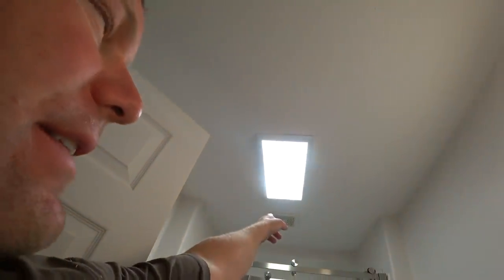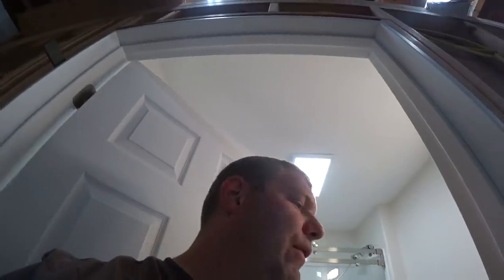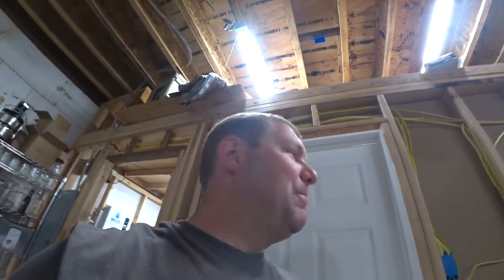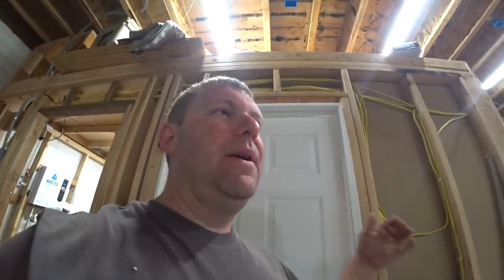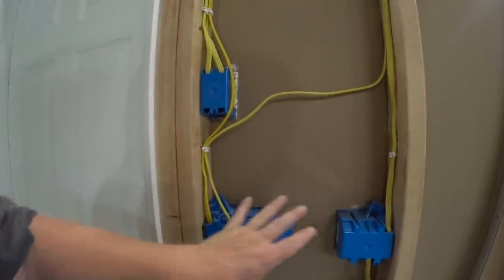If you've seen the video where we failed our first electrical inspection, that's one of those little details that we didn't get right. In our bathroom circuit, we actually have a fan and a light. That little light and that little fan were on a 14-3 wire because they're tiny. They don't draw hardly any current, but they're wired into the bathroom circuit, and code requires the bathroom to be on a 20 amp breaker. And therefore, everything in the bathroom, regardless of its size or current draw, must be number 12 wire. Details.